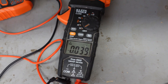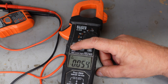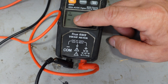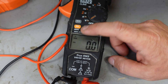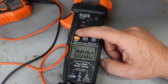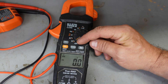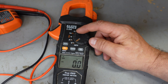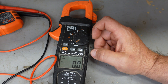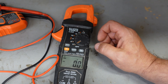Right now we're in AC volts. By pressing the select button on this meter we now show DC - the straight line with dots underneath it - which means it's in DC mode. This will not read AC. To switch between the two, press that button. Not all meters are the same; some have two separate settings covering voltage, amperage, resistance, and Hertz. The most important thing is to read the user's manual for the multimeter you use.